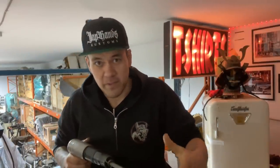But the first video is about hammer forming with an air hammer. We've talked about hammer forming with an air hammer here before, but I just wanted to reiterate how many different uses there are for it. Like the one video that we did, hammer forming in a wooden buck, and I used an air hammer, this air hammer right here, and I used it right in the grooves of our wooden hammer form to make beads. That's something that you can do, but you can also do a lot of other things with it.